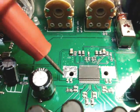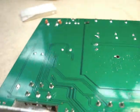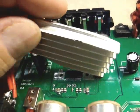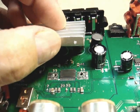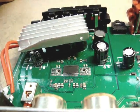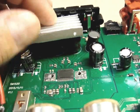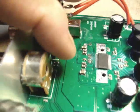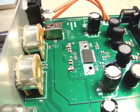I've very carefully drilled two small holes, one here and one there. It comes through on the other side and a small screw is going to be put through there. I've modified this heat sink to go in here. I'm going to put some heat sink compound there, and I've already tapped the screw hole for this screw. I had to do it this way because these surface mount components stand up over the board, so I needed something that would not interfere with that.